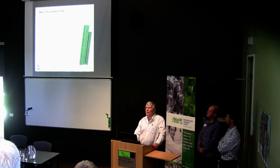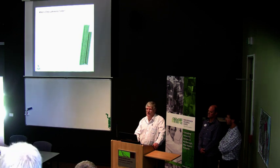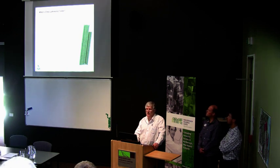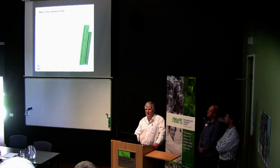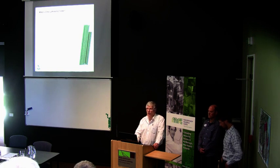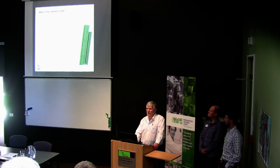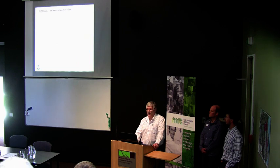We can make these panels up to 400 millimetres thick, and we have a whole range of different panel configurations depending on what the architect and engineer want — any length up to 15 metres, any width up to 3.4 metres. These panels can be used for floors, walls, or roofs. We can also put them together with other engineered wood products like LVL or GluLam to make composite structures, and also with steel where circumstances make that a sensible design solution.